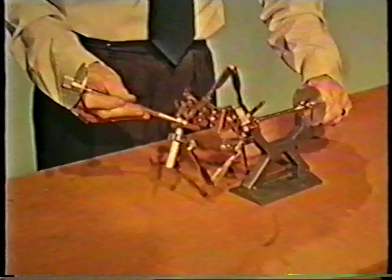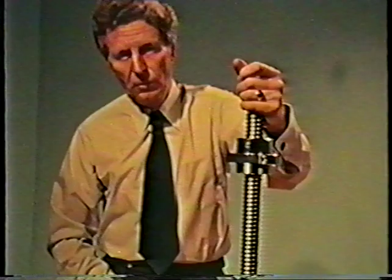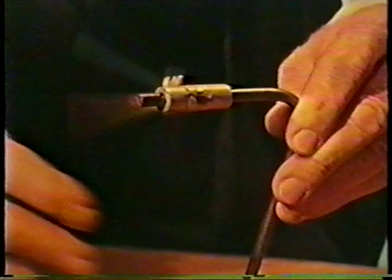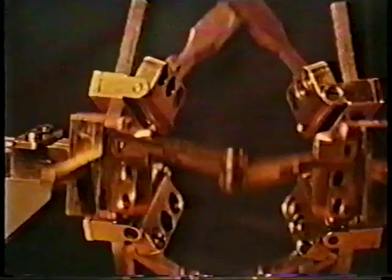The theory reveals that there are many other ways of disposing these five freedoms in each connecting chain. For instance, the hinges needn't be successively at right angles, so long as one side is always symmetrical with the other side. One can even replace simple hinges with symmetrically disposed screw-nut joints, or make use of joints that have two degrees of freedom — for instance, joints permitting rotation as well as axial translation, usually called cylindrical joints. But symmetry remains an essential ingredient.